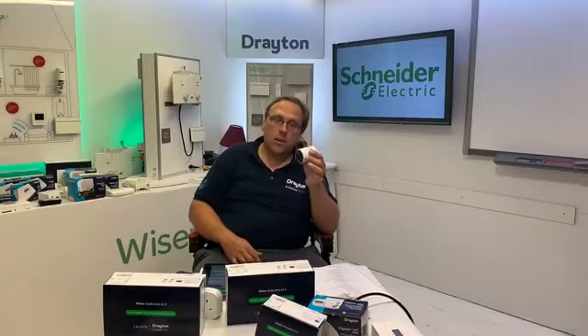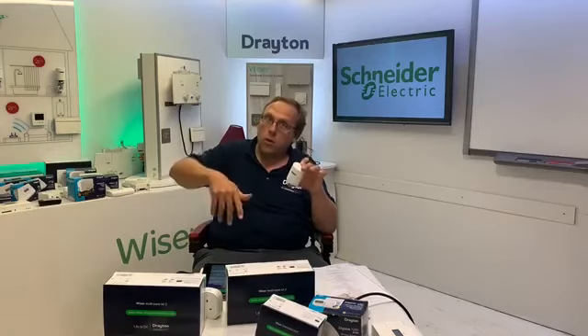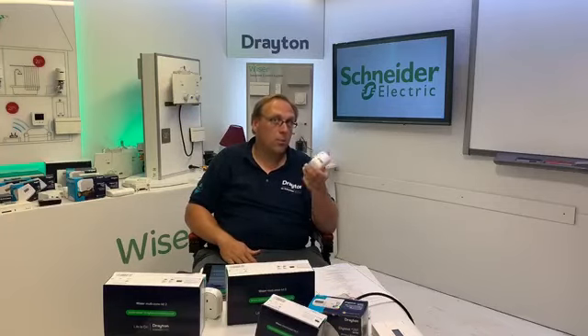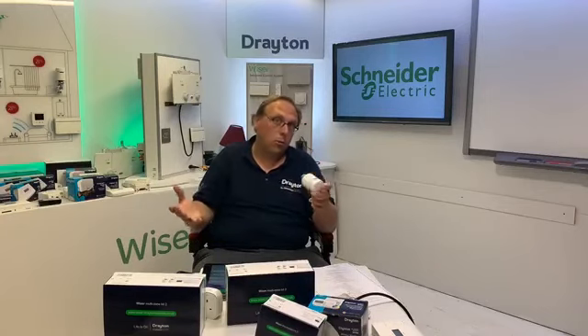Finally, if you're upgrading to a full multi-zone system, just be aware of the valve bodies. I tend to carry the adapter kits on the van. If the customer starts talking about multi-zoning, quickly check if the adapter fits on the body. The general rule is: if it screws on nice and tight and the adapter sits nice and plumb, you've got about a 95% chance of it being able to control that radiator. If the valve bodies aren't suitable, you'll need to change out the valve body, which could protract the job.